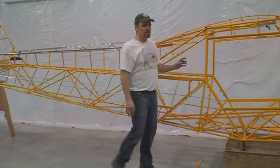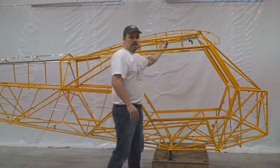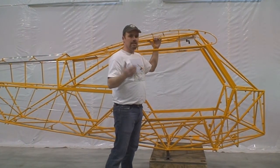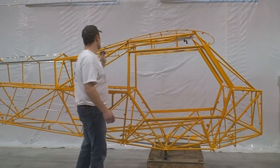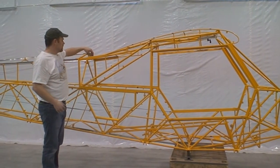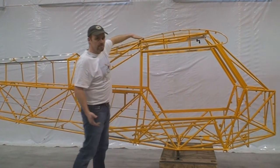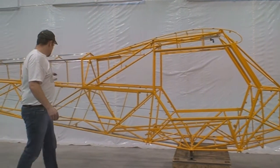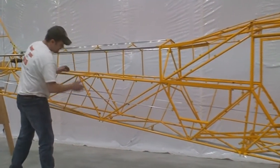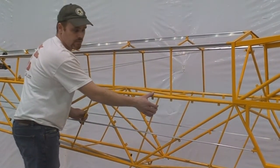We have some popular Alaskan mods incorporated into the aircraft. Up here in the top overhead we have an X brace that adds a great deal of strength to the wing when you get any kind of side impact on the wing. We have also added shoulder seat belt harness attachment points — one here for the rear passenger and one up here for the front passenger. When we get further back, where original Piper had their tubes come down and back up, we've added these little three-eighths inch tubes as a stiffener that adds some extra support to the tail.